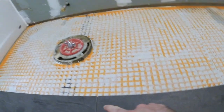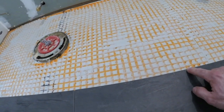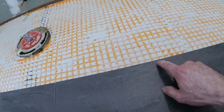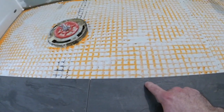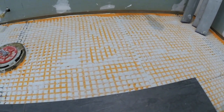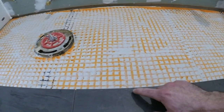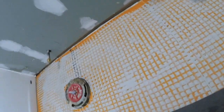The way I like to do it is I measure the tile. So what I did is I measured from this edge of this tile 11 inches and 11 inches that way, and then roughly that's my center. So I measured it, came up with 11 3/4. That's my exact half of the tile. And what I do is I split this half from here to here, another half, and that's 5 7/8. So to check what I got against this wall, I measure from here. This is going to be my half piece from there. That's going to be my 3/4 size piece, or a 1/4, whichever you want to consider it.